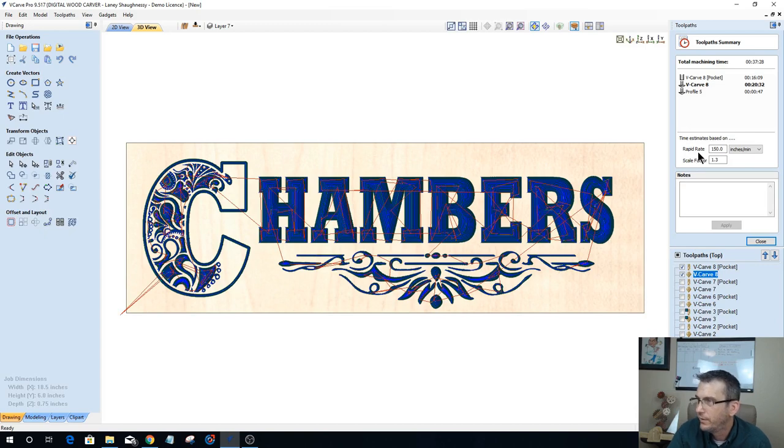So, hopefully, whoever asked that question, Chuck, hopefully that answers your question. So flat depth with the V-bit only, because it has to do all that flattening out with that little tiny bit, is an hour and 16 minutes. Flat depth, doing a tool change from the V-bit to the end mill for the flat area clearances, knocks off about 30, 40 minutes. So from an hour and 16 minutes to 37 minutes.